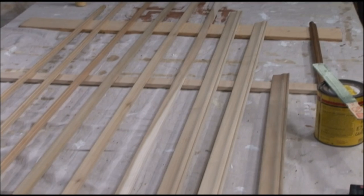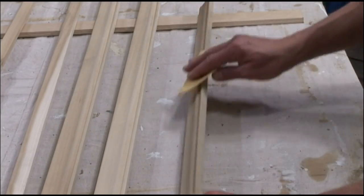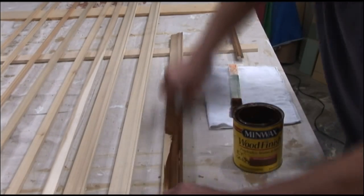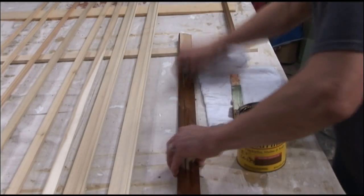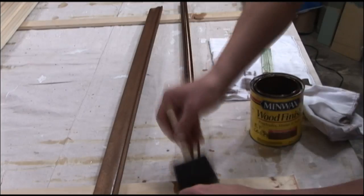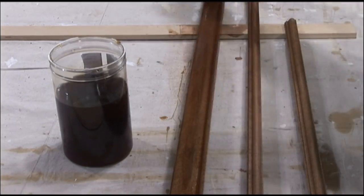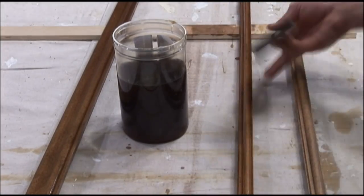Now let's take a look at our exterior trim. To prep the trim for installation, we'll sand, stain, and polyurethane it before putting it on. With 220 grit sandpaper, give every piece a nice smooth sand. Make sure your working area is dust-free. We're using Minwax wood stain — give it a good stir, grab a clean rag, dip it in the stain, and give an even coat over all trim pieces front and back. Use a foam brush to get the stain into the grooves. Some trim has a lot of detail, so start with the foam brush and finish with the rag. Inspect all pieces before sealing with polyurethane — apply it with a foam brush for a nice even coat. Do the tops and sides first, then when dry, flip over and coat the back.